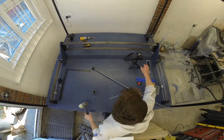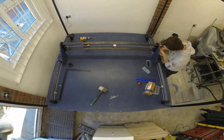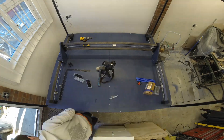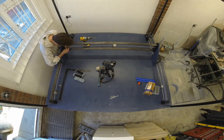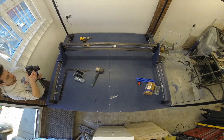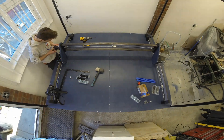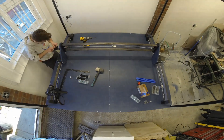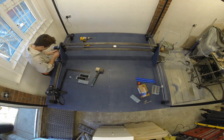You can see I spent a bit of time making sure that the x-axis was perpendicular to the bed. This wasn't necessarily the right time to do this, as the spindle needs to be perpendicular — so make sure there is enough calibration later on once the spindle is installed. I did go back later on off-camera and squared the spindle up to the bed.